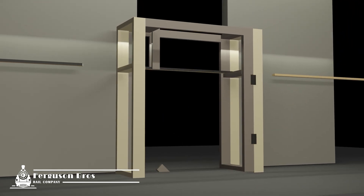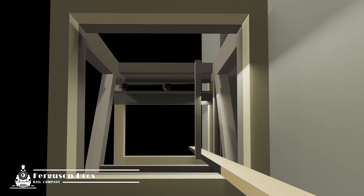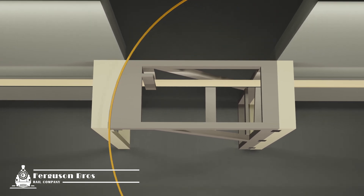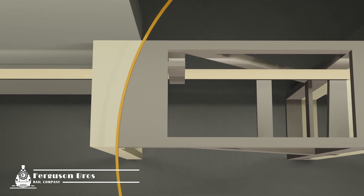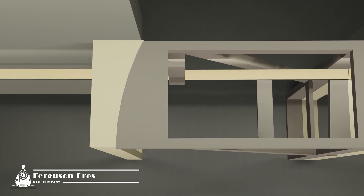The gate is a 90-degree structure with reinforcing. It will be secured with three hinges to take most of the weight. We'll use ball transfer units to take up any slack at the joining end — these are essentially enclosed ball bearings. Looking down from above you can see the arc required to enable the gate to swing with a consistent gap. This is why we need to offset the left side of the bench work, to provide enough space to handle the overlapping materials without protruding into the doorway space.